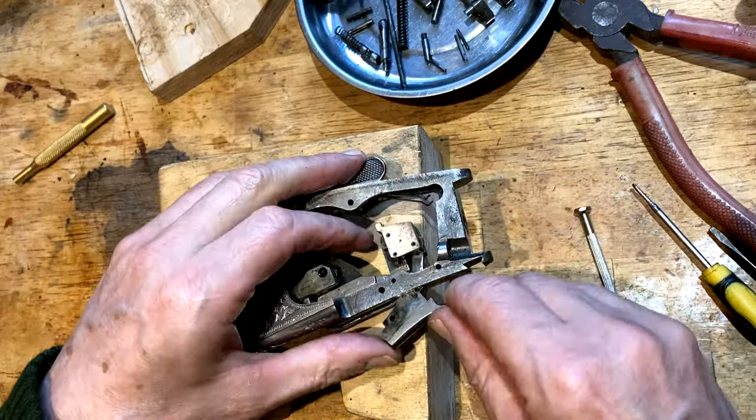Obviously, there's a little Allen key there, a grub screw, so that's the locator point. This wants a little bit of grease again. Not huge amounts, just to make, whoops, slip out my fingers. You could use oil if you want. Just drops in around there like that. As you see there, see how that goes? Right, a little bit of grease or oil. I will drop a bit of oil in there because it will just flow better.